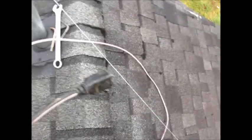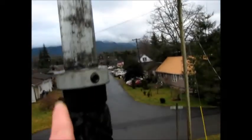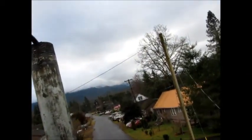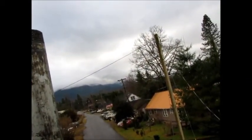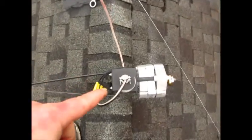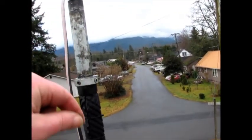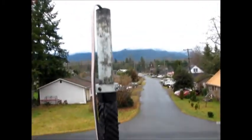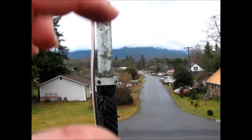Now I take the other end of the wire and I slide it down the pole, inside the pole. Now make sure you put your lower locking collar on before you do this, okay. So you slide this down the pole, and then what I do is I just lift the whole thing up and kinda jiggle the wire—the wire will automatically slide down the pole because of gravity. And then I just set the PMA and the mounting and everything all on top of this pole.